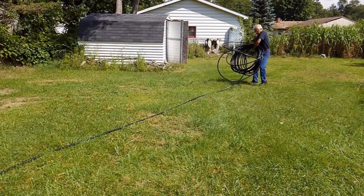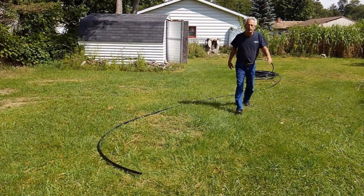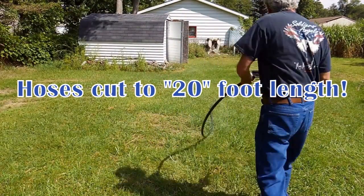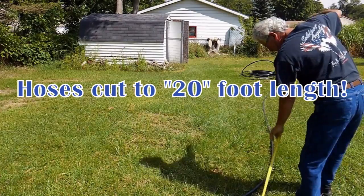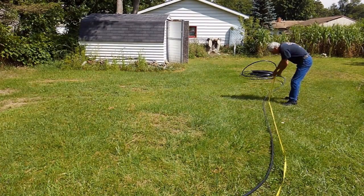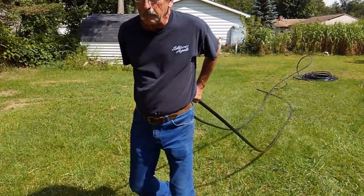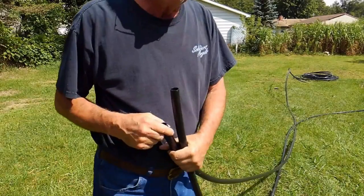My first well I didn't know. Very interesting. So they're all going to be about 15 to 17 feet, and so I know exactly how long I'm going to make them. We're going to cut four hoses at about 17 feet and put them together in pairs with a turnaround — all three-quarter inch tubing. It's going to have a turnaround at the bottom with double clamps on every tube, and we'll get these ready to insert as soon as the drill string is taken up out of the hole so no dirt comes back down plugging it up.